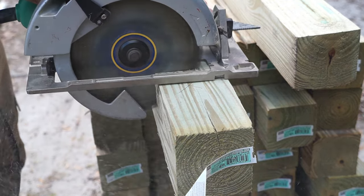You can see here I'm taking a piece of flat bar and I'm literally weaving it through the fence. This is going to be my pull bar, and I've made a jig years ago when we installed the chain link fence around our tennis courts, and it's basically a 1.5-inch diameter pipe with a couple of J bolts.